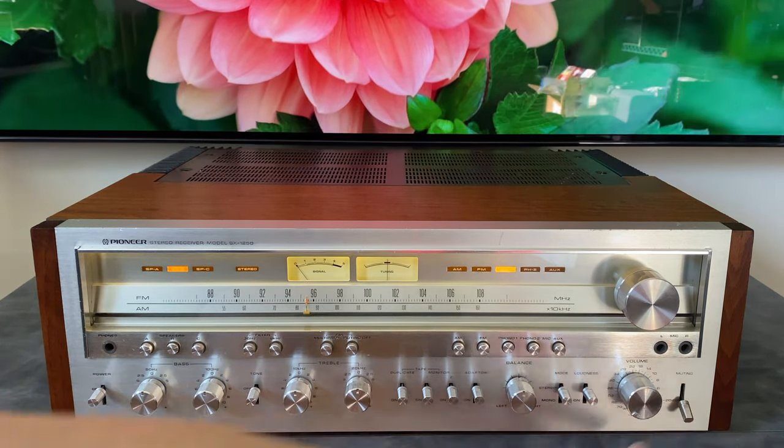On tape 2, it's the same thing, except we have a DIN jack here that puts the function of this. There's 5 pins, so there's one ground and then 4 other pins to allow you the same connections but in a single cable. This would go between like a Pioneer tape deck and the SX-1250 just to clean up your cabling. And then the adapter, this is a loop that can get activated on the front.